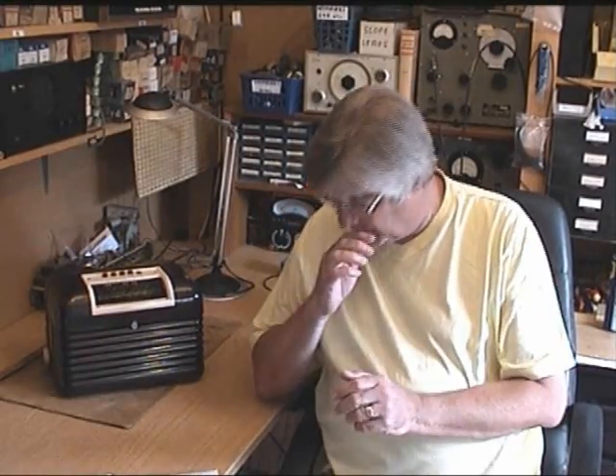Hi, my name is Ray. Welcome to the Radio Workshop and Part 2 of Aligning SuperHET Vintage Valve Radios. In Part 1 we basically went through how a SuperHET works and we got to the IF stage, which in our example was 470 kHz. We talked about the bandwidth being too wide or too narrow. So now let's start adjusting the IF transformers.